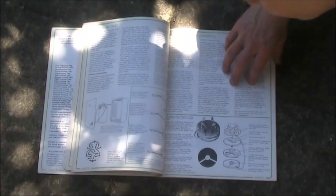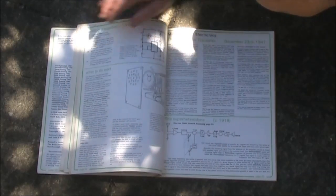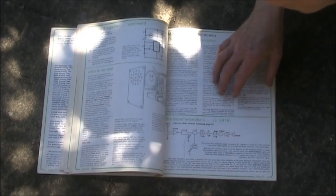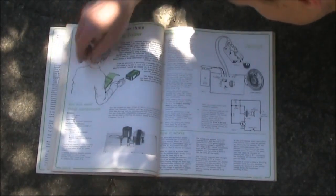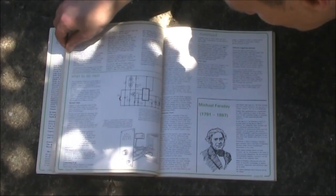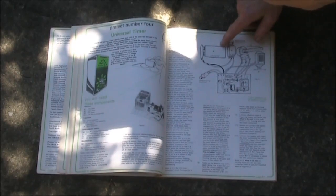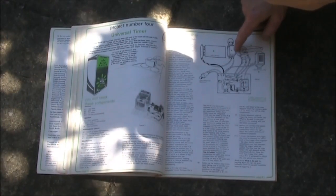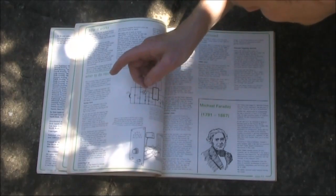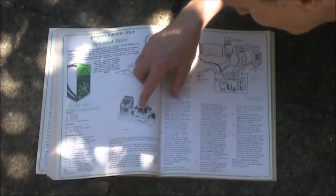Starting off with a flashing LED which could be made into various other things like a flashing brooch, a doorbell using a 555 timer. Interspersed amongst the projects were various bits of electronic history and theory. There was a Morse code trainer, a universal timer. One thing to mention with the Funway 2 kits is that you just got the board and the components. If you actually wanted to make the kit of practical use, you had to buy some extra things — for instance, a switch, potentiometer, buzzer, battery, and a box. That was another trip to Dick Smith — more money spent, more sales for them. But it did keep the cost of the basic kit low, and you might already have enclosures or salvage components you could use instead.